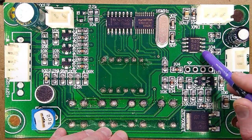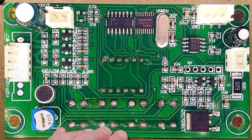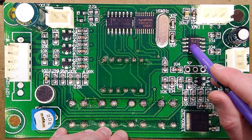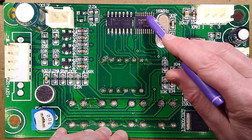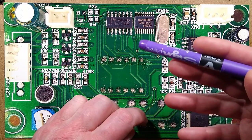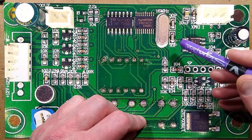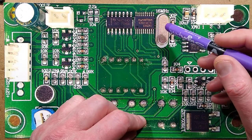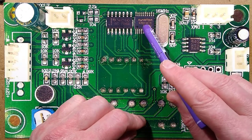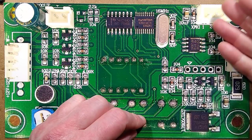It has the RS485 bus driver. This is the DMX receiver. Sadly, the pins that determine whether it's receiving or transmitting are actually controlled by the processor, one pin of the processor as well. And that means that this is a sort of universal board. It's designed so that if the software can accommodate slave and master mode, if it doesn't detect DMX, and you've got one unit set up as a master and the other units set up as slaves, then this will send out information onto the network again, and that then allows it to actually signal to the other lights what they should be doing.